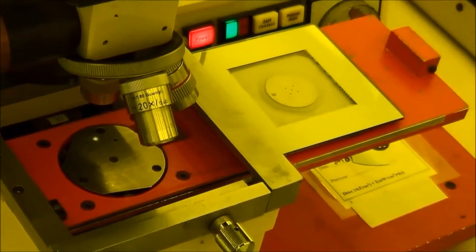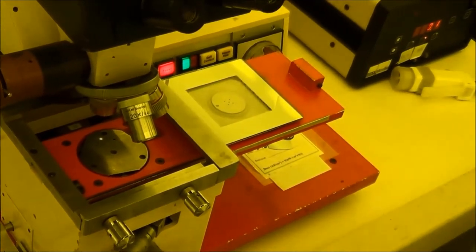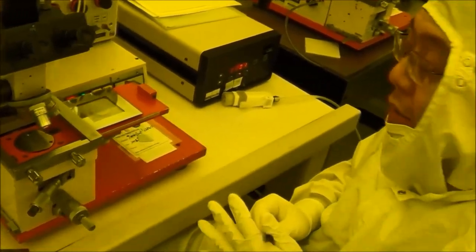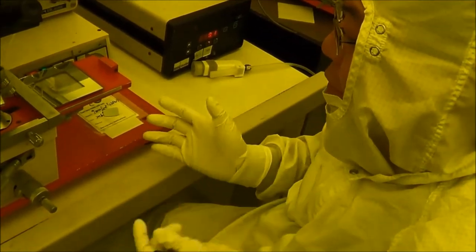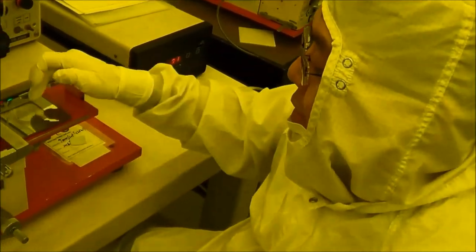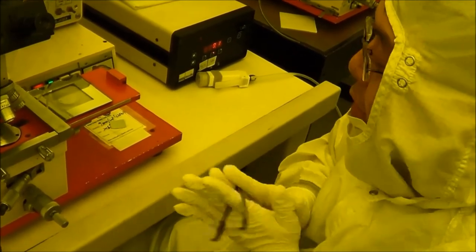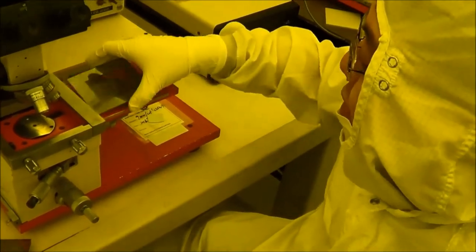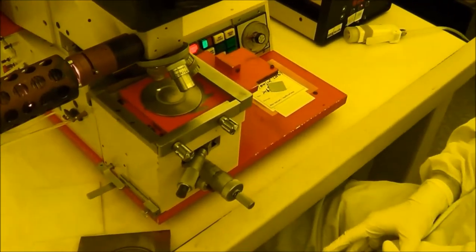I mean, nitrogen will be pushed from the bottom to up. So that means more pressure will be applied to your sample on the backside, so you can make more tight contact. But this mode also will probably scratch or damage your mask because there will be very hard contact between the sample and the mask. So the high vacuum mode is only used for less than 1 micron or 2 micron.